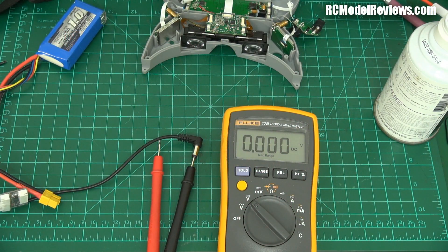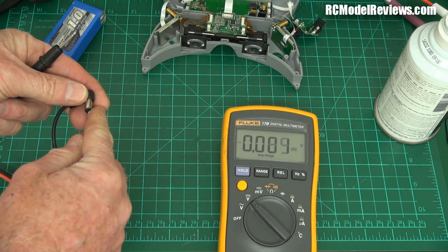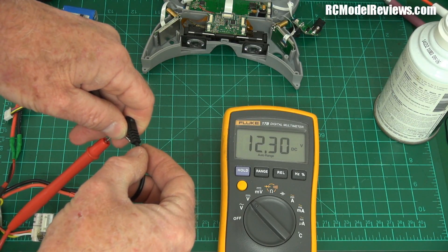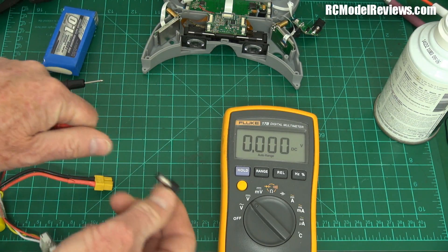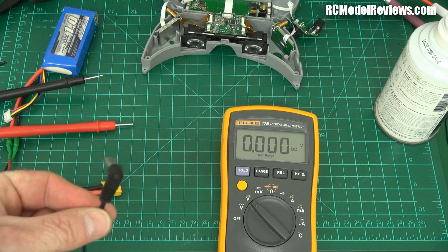I've had a good look over the goggles themselves and couldn't find anything. I ran it with an external power source — no problems at all — which led me back to the battery lead. I've tried these goggles with a different lead and they did the same thing, but I wasn't 100% sure. I'll just give this cable a bit of a torture test. I've got my meter on here. I'll put my meter on the barrel connector — 12.3 volts, that's nice. Watch what happens to the meter when I move this around. Did you see that? Look — 0.2 volts. The lead is faulty.